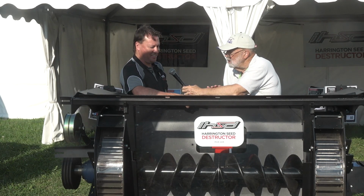And so once you have checked the necessary boxes, then you can flip the switch and employ this on your combine. Start destructing those seeds as soon as possible. And it'll do water hemp. There's no doubt about that. Jump onto the website. You can see the tables that have been created by the University of Arkansas, against the common weeds in the US. We kill generally 99% of most weed seeds that are common in the US. Water hemp, we get definitely over 97% of it. Palmer amaranth, again, we see sort of 97+% kill on that. You may need to slow down a little bit to pick up those weed seeds when the plants are very lush and wet, but obviously it's worth the effort.